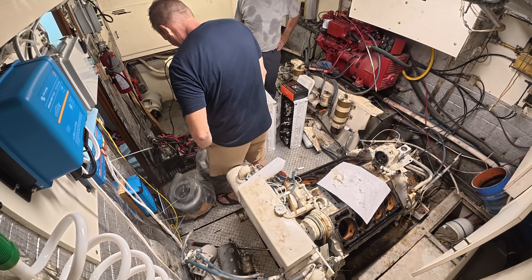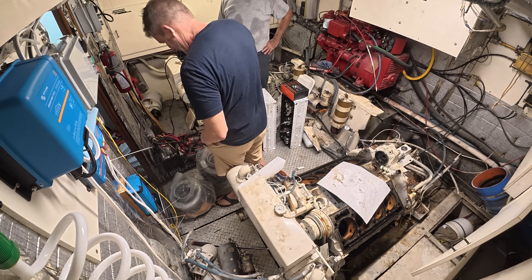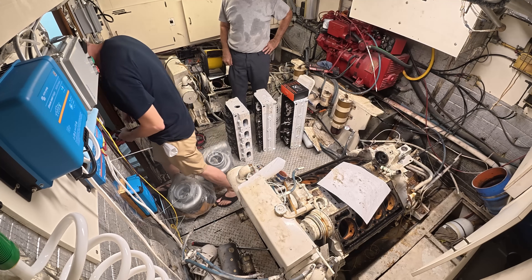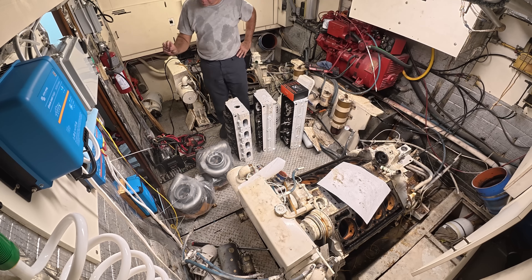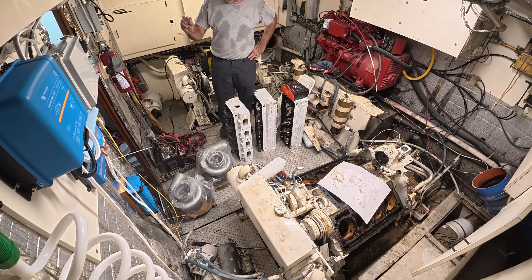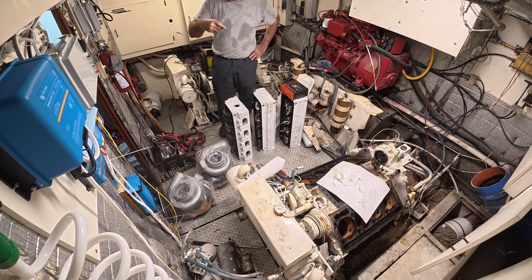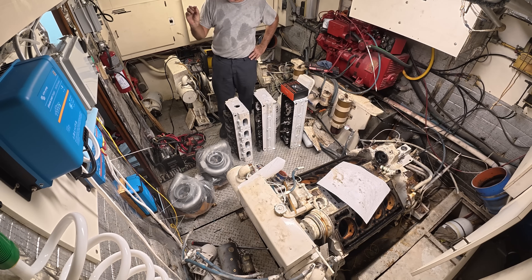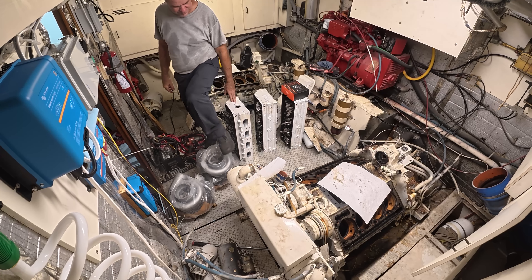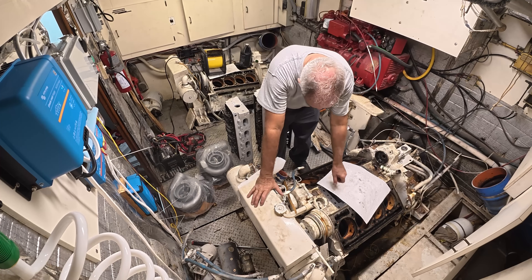Man, look at those. Wait till you see the back where he CNC'd them. The exhaust was all rotted out - there was about a quarter of an inch space between the blades and the housing. He just drilled them out with the lathe, stuck in a steel pipe, then turned it over. Perfect. He's the only guy in Miami that does that - the only one that spent the money on a machine like that.